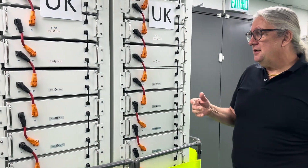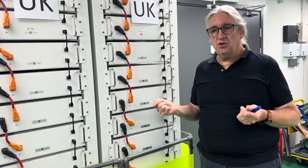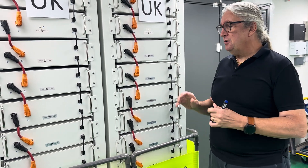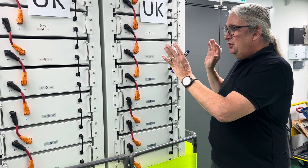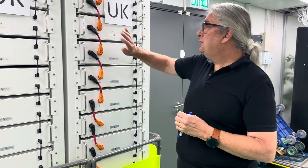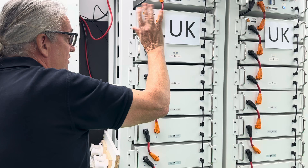If you buy the kit, the first thing you'll do is assemble the racks — that takes the longest time. We are introducing doors onto these racks because of new standards, which I agree with. You don't want to be able to unplug a battery while it's running and discharging, as that creates an arc. So we're including door units to give protection. Use rubber gloves, take care of the high voltage, and if you haven't done training, please do some basic training before connecting.